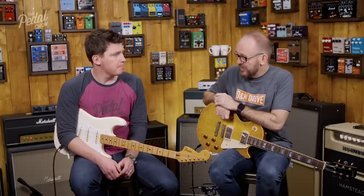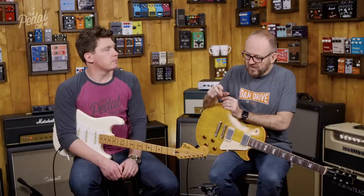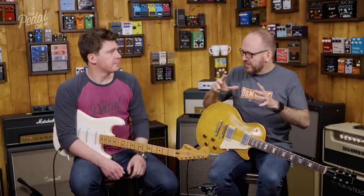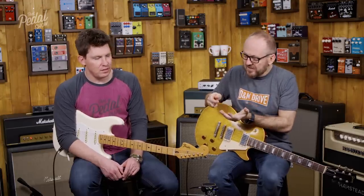When guys first started cranking up their amplifiers and getting all of the saturation from the amplifiers, they wanted to take that further. And that's a concept that we've talked about all the time. If you try and push it with a big, full, fat overdrive, it just compresses more. It doesn't really go anywhere. So they developed a treble booster circuit, which just pushes from the mids to the top end. And because you're cutting off all those bottom end frequencies, the amplifier has somewhere to go when you push it like that, and produces a sound that's incredible. You think Tony Iommi, of course.